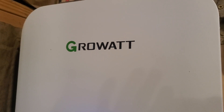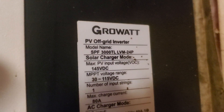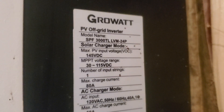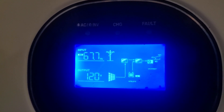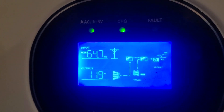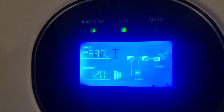I'm making this video for anyone who uses the Growatt inverters. Mine specifically is the 24 volt — this is the American model. When it comes to using a generator, which is allowed on these inverters, it can be a bit of a pain, because you will get this little flashy light right here for the power pole, which is for your line power or shore power, and the problem is that it blinks, showing it is not connecting.